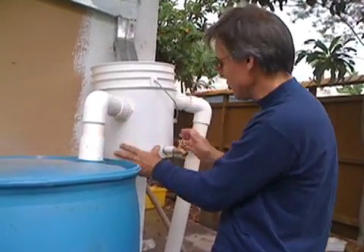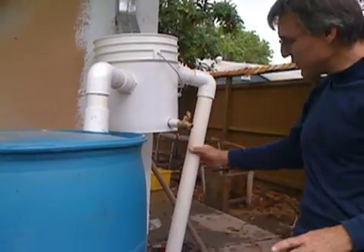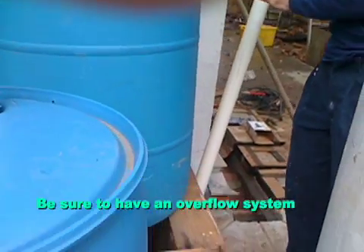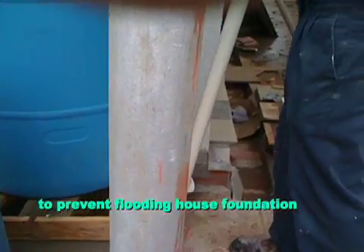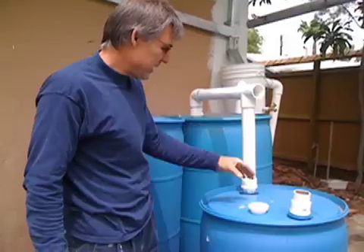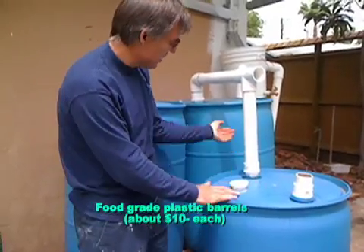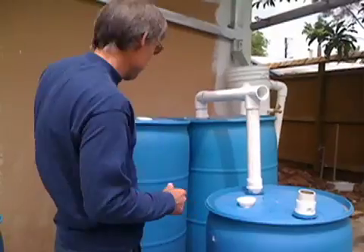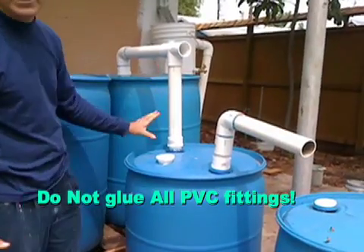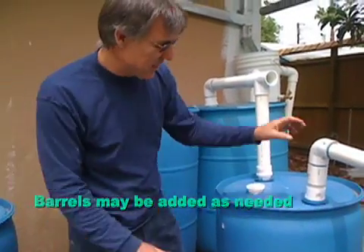You can save your old toilet fittings and things with rubber gaskets to help make sure that everything fits without leaking. I have an overflow here that goes down to the storm drain system in an emergency, and that's set up higher than the intake to my first sediment trap, which flows into the primary tank. Then you have the bung holes — there's an unmodified drum — flows over, and then I can add on another one here. I haven't glued anything, it just fits together. It's a little leaky, but it works. Most of the leaks will just drain away, no problem.